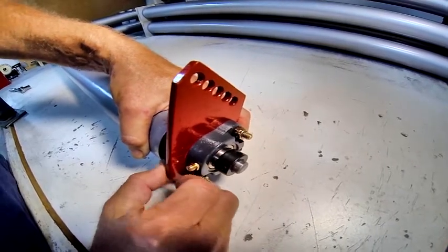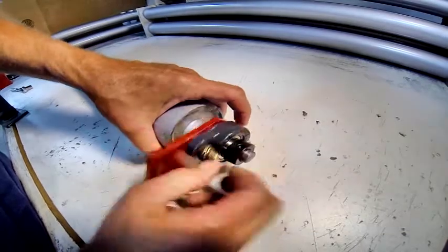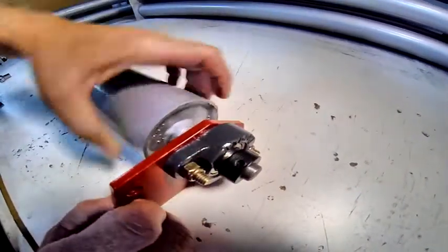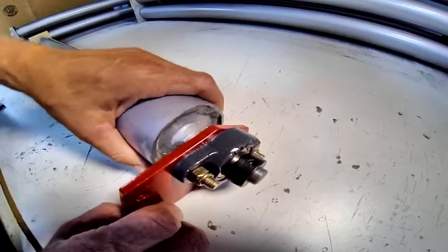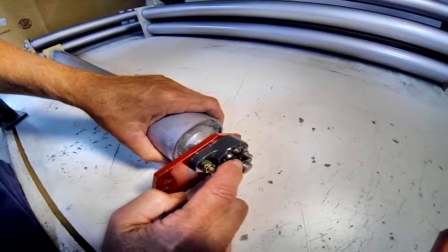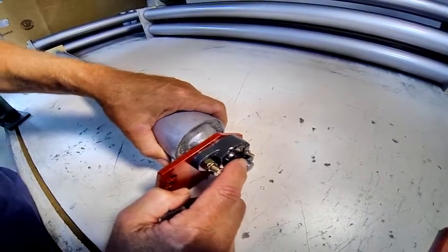The other part that's so important about this is you'll notice there's a blind hole right there, and there's a set screw right there. The blind hole is actually used for setting the locking collar — locking it to the bearing.